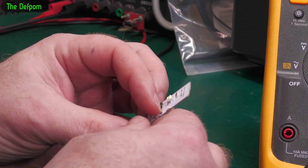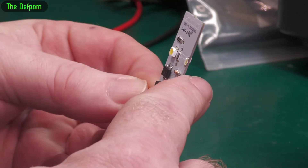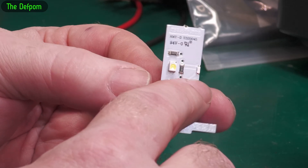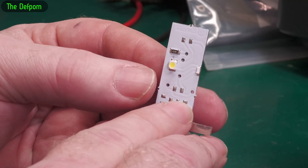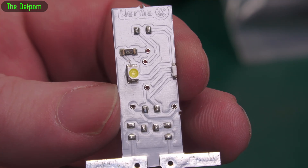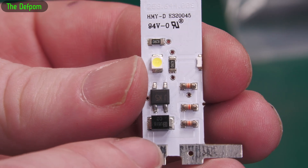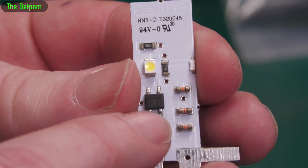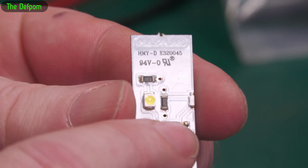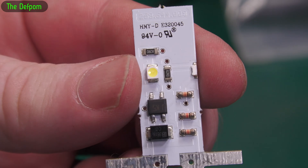I've been asked to look at this interesting lamp. It's an active lamp with LEDs - one on each side, four LEDs total to create a 360-degree pattern. This side of the board has a single resistor here, 82 ohms. You can see the layout on the board. There's a TVS diode just here, looks like a diode bridge, and we've got three more 82 ohm resistors here - MELF resistors - then another 82 ohm and another 82 ohm. You can see the layouts on the board there.